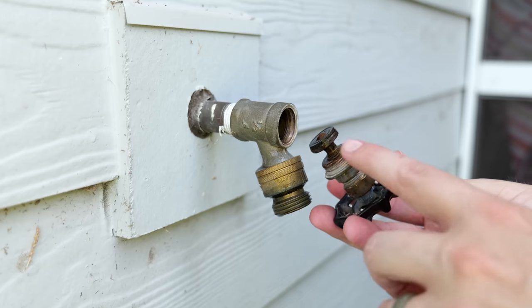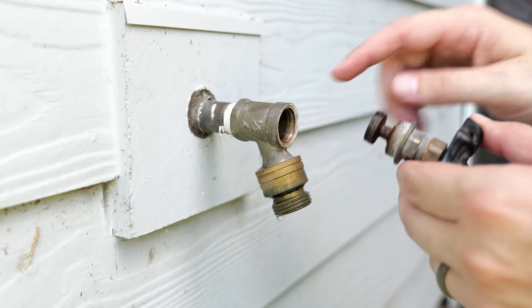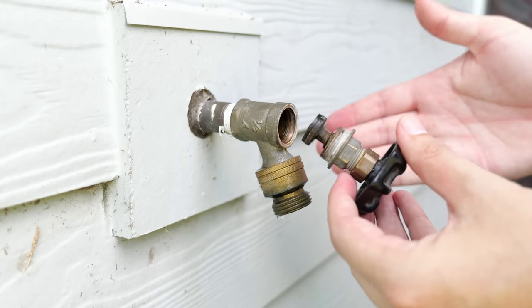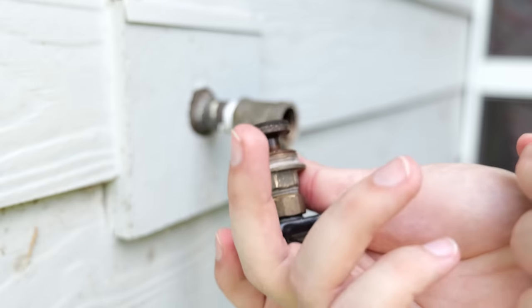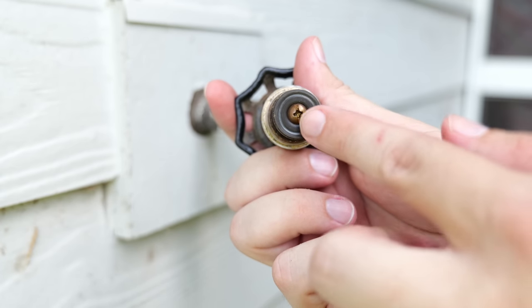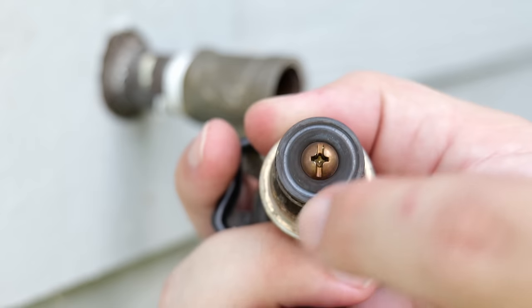As you can see the cap just screws off, and once we pull it out we've exposed that washer responsible for stopping water flow. For folks with a freeze-proof faucet, when you take this cap off you're going to have a much longer shaft — that's what makes it freeze-proof, as the shaft extends all the way into the house into the piping inside your walls which stays warmer. At the end of that shaft will be a washer just like this one, and the instructions are the same. Here's our valve, and at the top you can see the washer. Flipping it over, there's a Phillips head screw, and on the rubber washer you can see that little line going all the way around — that's normal wear and tear from being tightened down constantly over the years. They can be a lot worse, completely pancaked out, or you may see actual cracking from the rubber degrading over time.